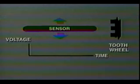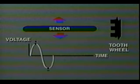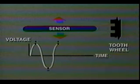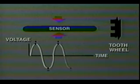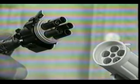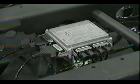The wheel speed sensor's magnetic pickup consists of a coil wrapped around a magnet, which creates a magnetic field. As the teeth and spaces on the tooth wheel pass by the wheel speed sensor's magnetic pickup, an AC voltage signal is generated by the building and collapsing of this magnetic field. This voltage signal is sent directly to the ECU, which uses the signal to determine the relative speed of the wheel.